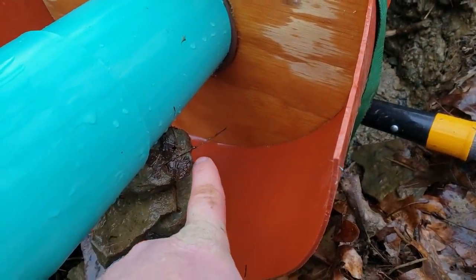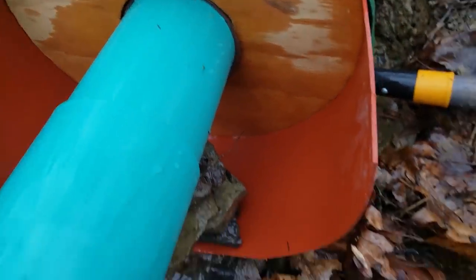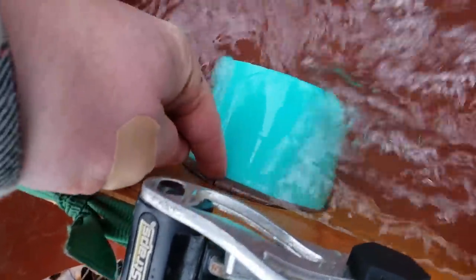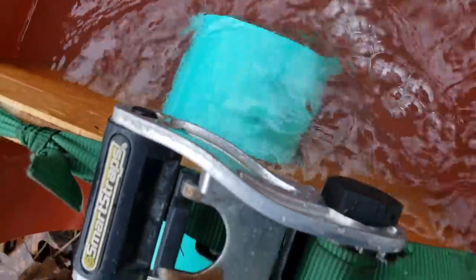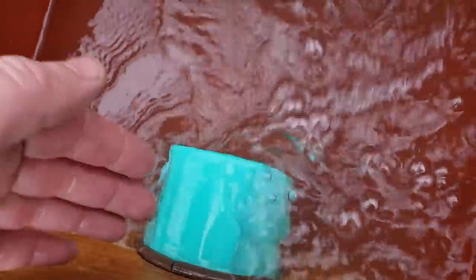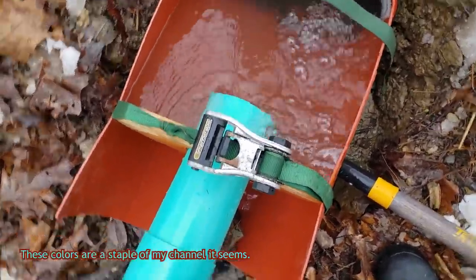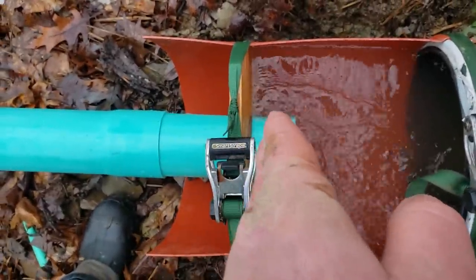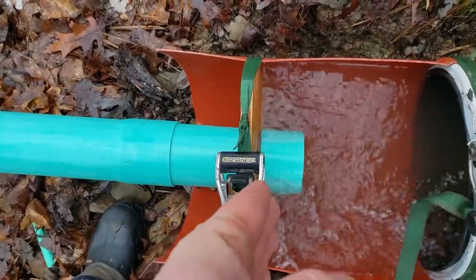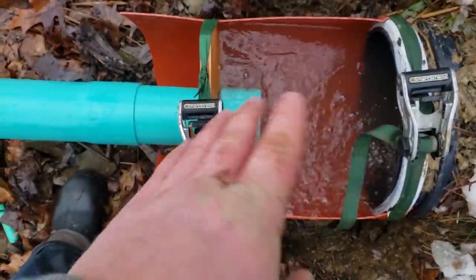I have a little tiny leak coming from right here. It's actually coming from the top — I think the hole that I have drilled in this piece of plywood is a little bit too big, and you can see water coming up against it. It's only in high flow situations, and my seal there is not perpendicular to the pipe. The plywood here is not perpendicular to the pipe coming out, so you can see that it's tilted off — and that's because the entire barrel shell collector is tilted also.